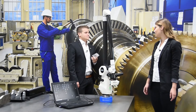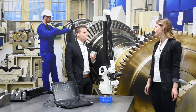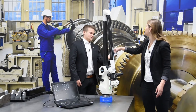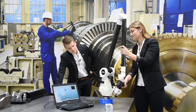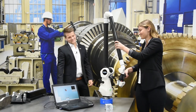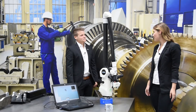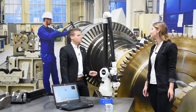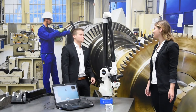The MLS100 with its wide laser line can also measure much larger parts than our example here. What is such a typical application? For example, a car door can be quickly measured with MMA and the laser scanner. See how fast we can get the data on our component with the measuring solution. Would you like to try it yourself? Sure. Wow, that was super easy. And I'm sure we can also use the LS series with a Wenzel CMM? Yes, we can. The MMA is a useful complement to your classical coordinate measuring system. You can use it with our measuring software WM Quartus, but also with our partner software like Polyworks or Metrologic.